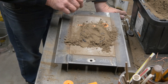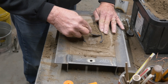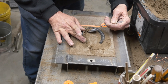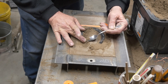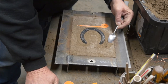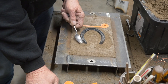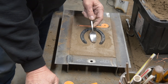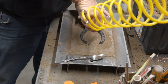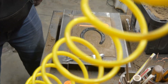After I get some of this excess sand cut away, I can start cutting down to the part line. I've got to go on both sides and try to cut down close to where that part line is going to be. I'm using the back side of the spoon to pack the sand down a little tighter and make sure I've got a nice straight parting line along the part. There's no real magic here — it's just a lot of cleaning, cutting, shaping, pressing. It's just repetitive action.